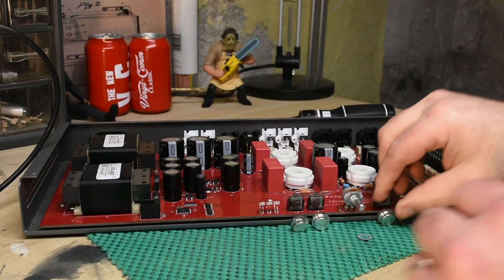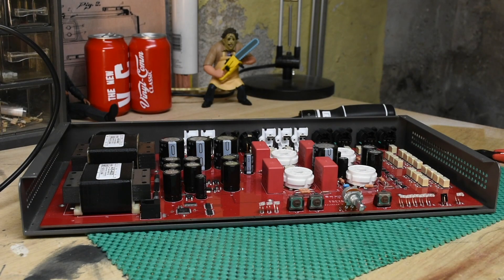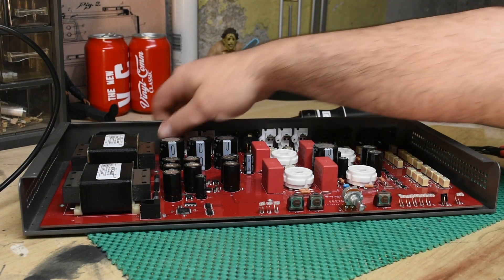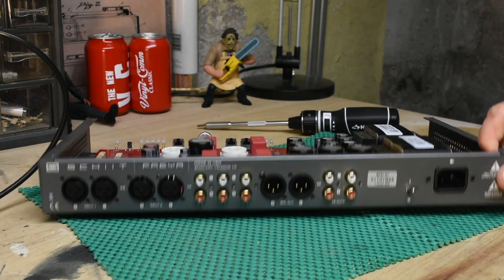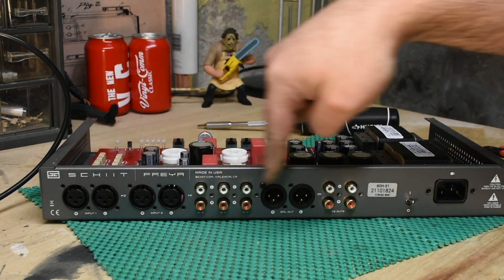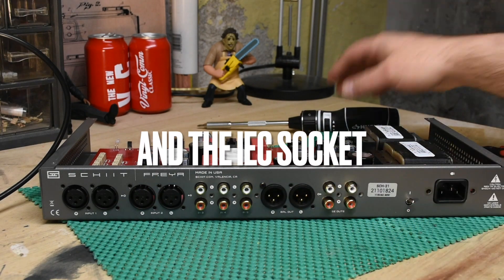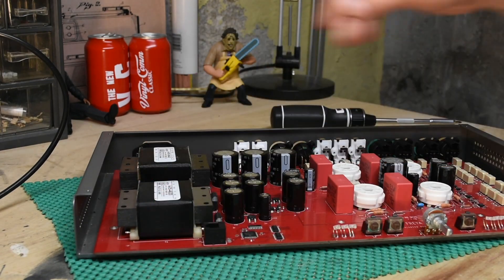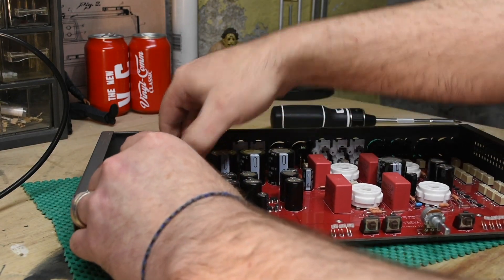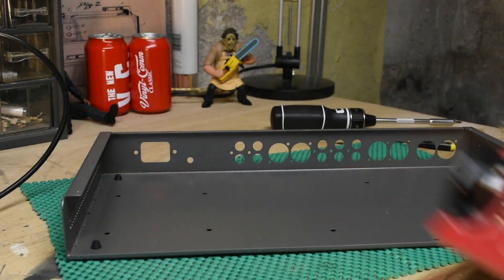Now you have this, along with your three buttons and your washer from your pot. The most annoying part: there are a billion screws in here to hold in the inputs and the outputs. Unscrew all of those. Now that that is done, this will slide out of there. If it doesn't slide out, you have missed a screw of some sort — do not pull it.